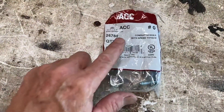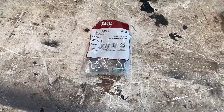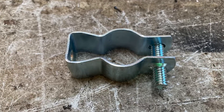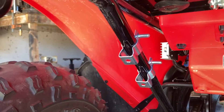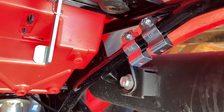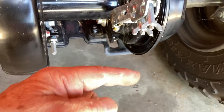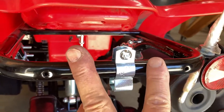The plan is to use some conduit hangers to mount on that three-quarter inch subframe and put some straps off of that to hold up a little trailer receiver. I've tried a dry fit with these hangers on the left side — pretty good, a lot of room. Right side is pretty crowded; I may utilize the bolt that helps hold the muffler in place to make a strap that comes down to the hitch receiver. Back bars have plenty of room — I'll probably put double ones there.